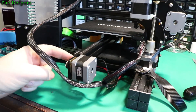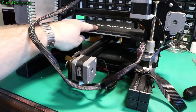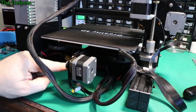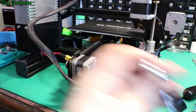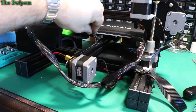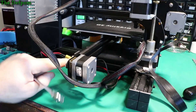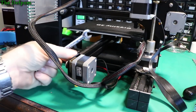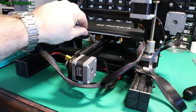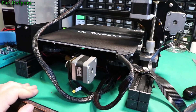I've got the motor on there now. Something else I did — this rail here is really narrow, so the belt rubs on it. I've mentioned this previously in one of my other videos. When the bed is down this end, the belt rubs on the channel and catches on it, and no matter how you adjust the motor it'll rub either here or on the bottom edge. So what I've done — I happen to have a spanner that's exactly the right width to force its way down this channel. I just wiggle it around a little bit to open it up, folding over the narrow edge. It doesn't cause any harm, and I've wiggled it all the way down the channel to about halfway. That means the belt is no longer rubbing on the side of the channel, so it should behave slightly better and not wear the belt out.